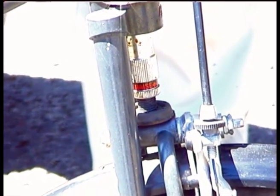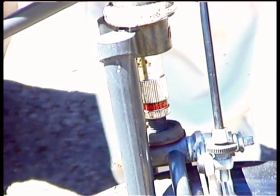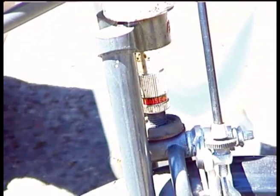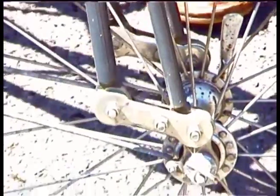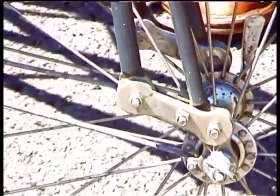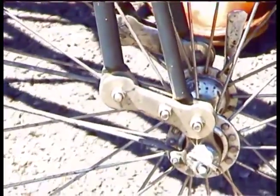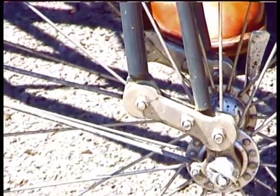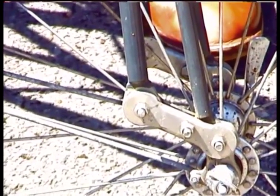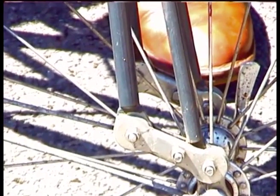At the bottom, underneath the silver and red unit, you can see a little rubber buffer, which is the extreme stop for when the suspension goes to full travel. Down at the bottom, if we move down to the bottom of the stirrup, you can see the leading links, how they're activated, and in there are polyurethane damping washers, self-locking nuts on the pivots, and they can be tightened up or loosened to give more or less damping to suit taste. They can in fact be locked to have no suspension at all, but that rather seems to defeat the purpose.